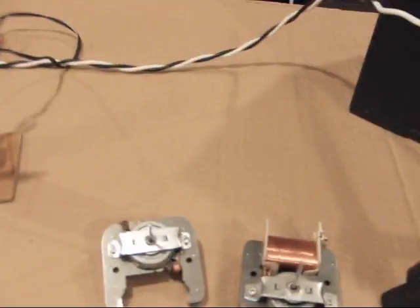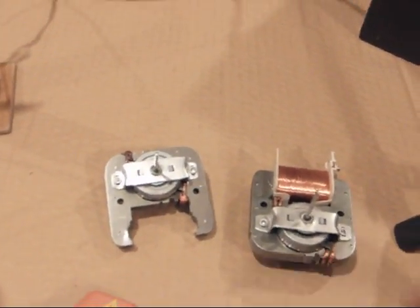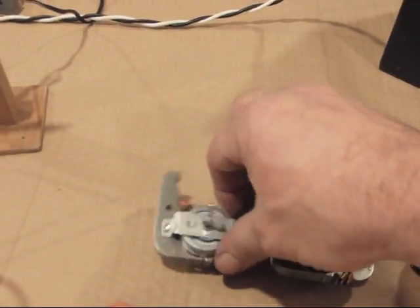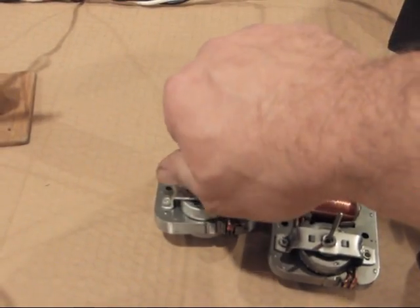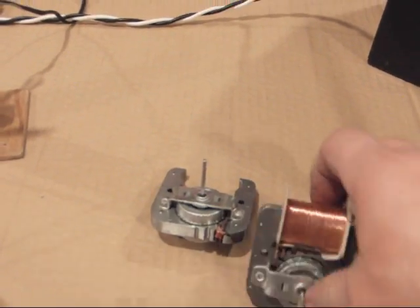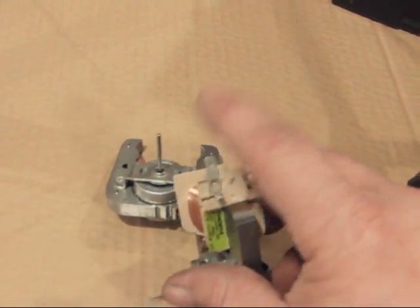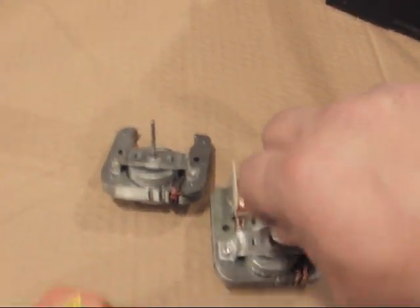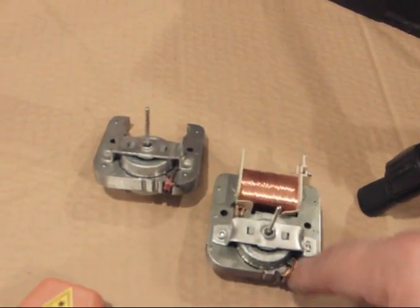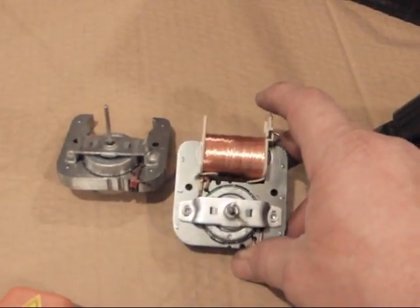What we first really need to pay attention to is how we've been producing and using electricity for the past hundred years or so. This is a modern-day induction motor. You can see here they have the horseshoe iron piece, which is called a stator, with a magnetic wheel. This is actually a motor with one winding — a coil, just one wire winding around and around to both ends. When you induce electricity into the coil, it causes the magnetic current to flow through the iron stator, creating magnetism, which propels and attracts the magnets on the wheel, causing it to turn.